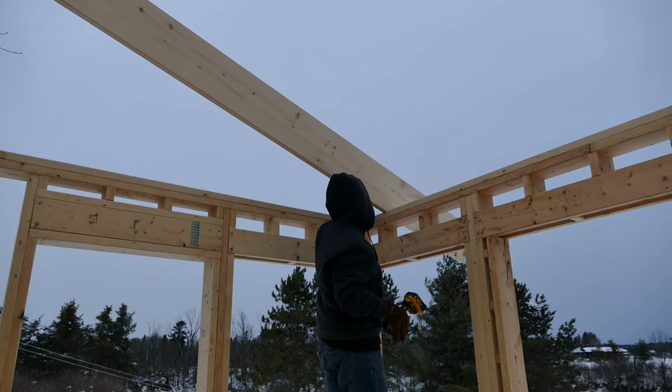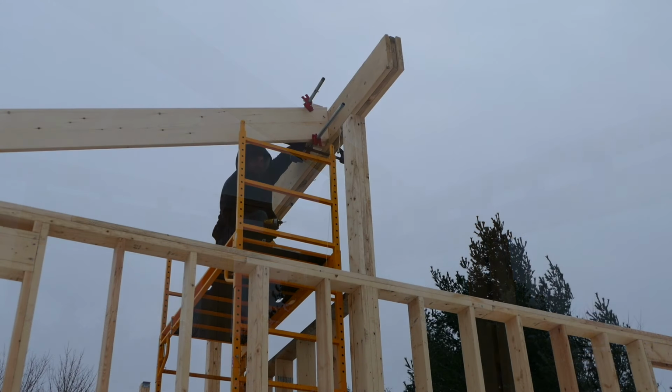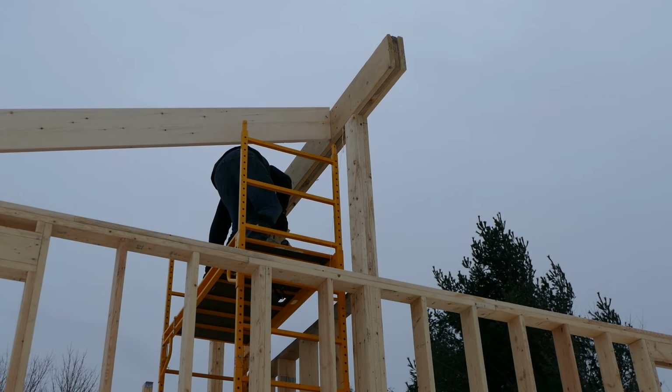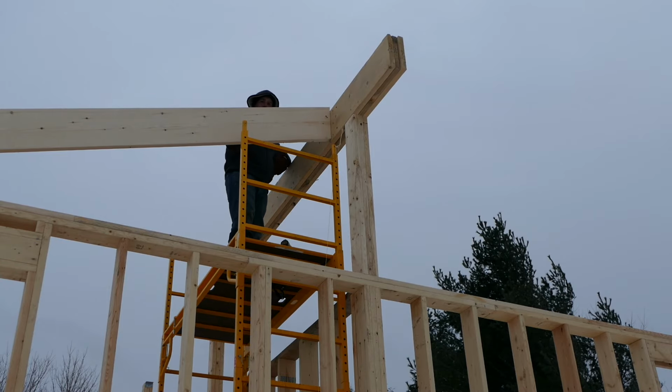That is on for life. Nice. All right, now this is the moment of truth. If I let this go, will it drop? No. Now what you do is you lay the sheet on top of this, and it overhangs maybe 3 inches, and then it meets in the middle to make your peak, but leaves a gap on top for all your airflow.